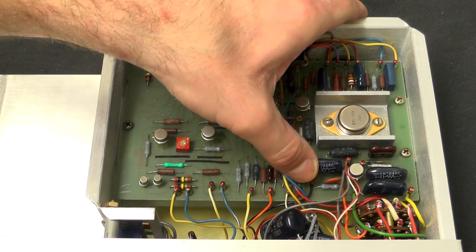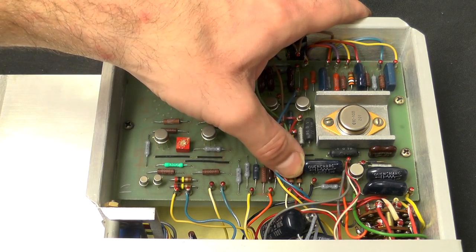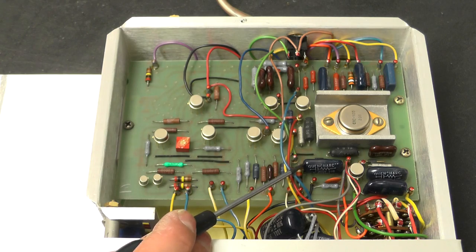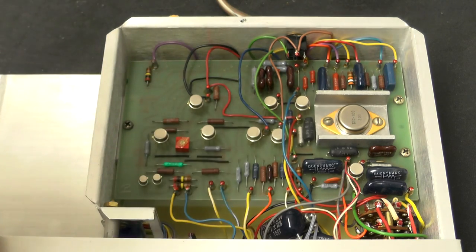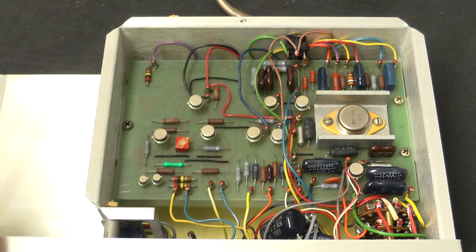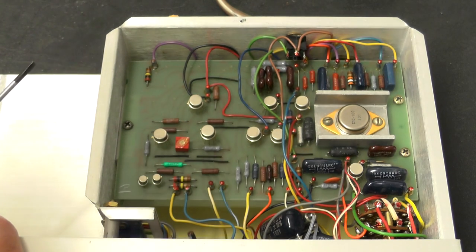We've got these, they look like RC filters. They actually have a symbol on there of a filter and a capacitor, and they're called Quench Arc. We've got this device here that is labeled G1C-100 and then 201. What that is, I have no idea. There's nothing comes up on Google on that one, but yeah, it could well just be a power amplifier.